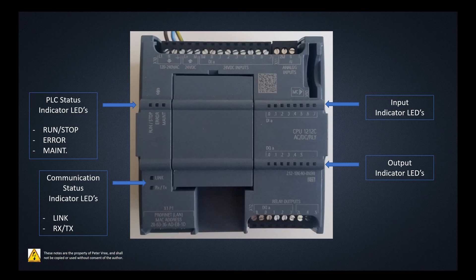That walks through the basics of the S7-1200 PLC. To recap: 120 or 240 volts AC power supply, which provides 24 volts DC to power the digital inputs. We have two 0 to 10 volt analog inputs, indicator lights for inputs and outputs, 6 relay outputs, and communication over PROFINET. Keep going and we'll start with how to download your program and get started with the Siemens S7-1200 and the TIA Portal. Thanks very much, we'll see you in the next video.